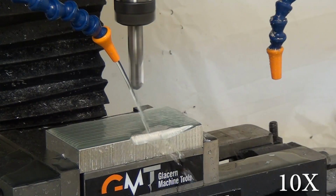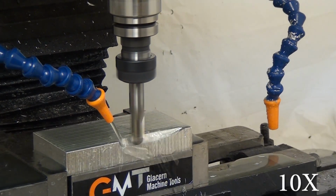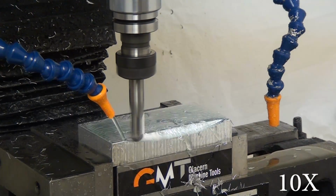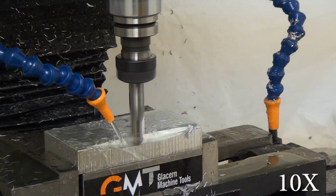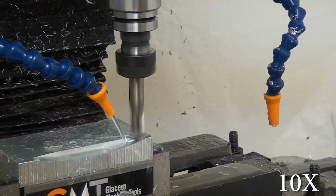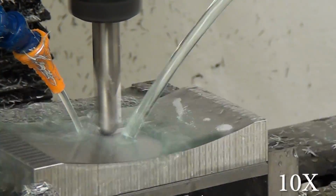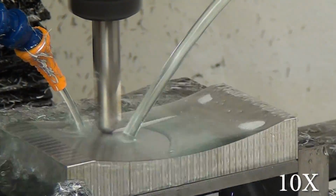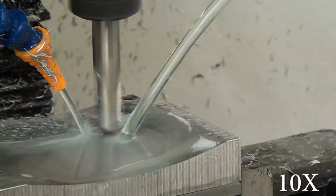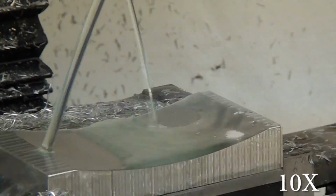The only reason I'm showing you this footage is because you're going to notice my standoffs have this scalloped clearance area, and that was intended to be clearance for the large belt pulley that attaches to the motor. After I got the whole thing assembled, I realized I did not need to clearance this, so it's not in the drawing, and you won't need to perform this step. It just kind of makes it look cool, I think, but it's extra time that you don't need to spend. So forget about machining this shape into each of the standoffs.